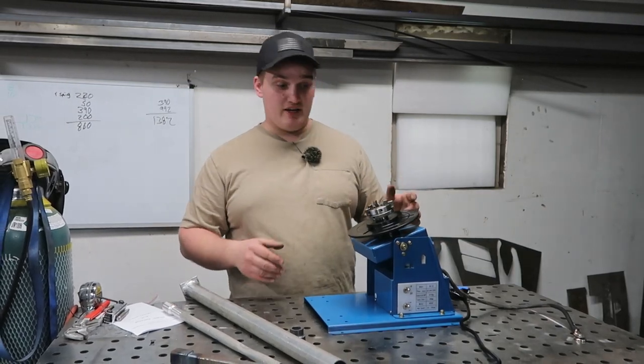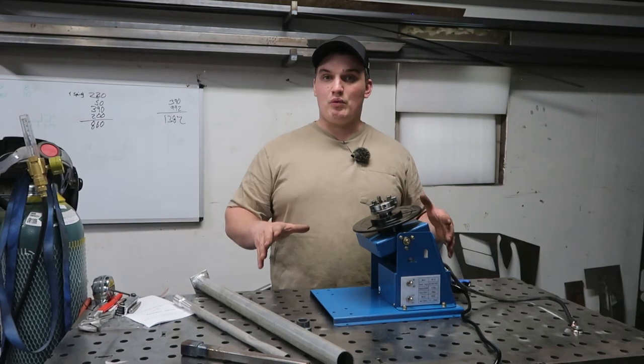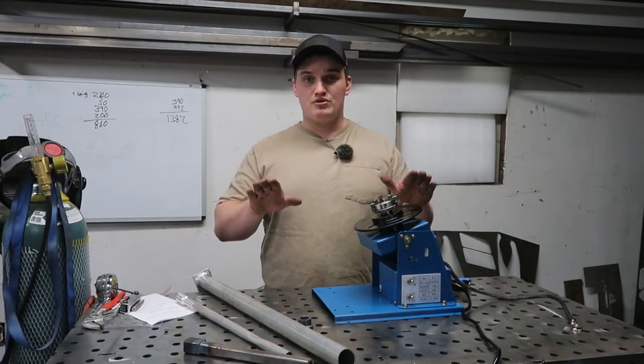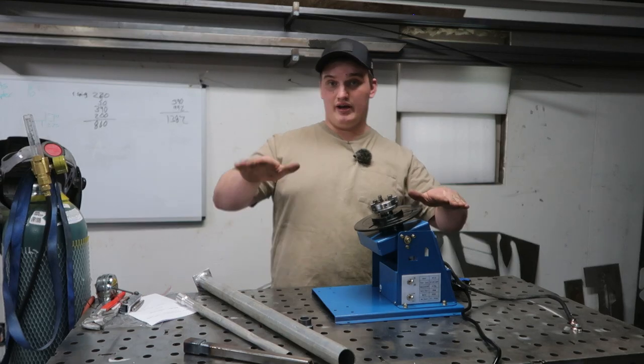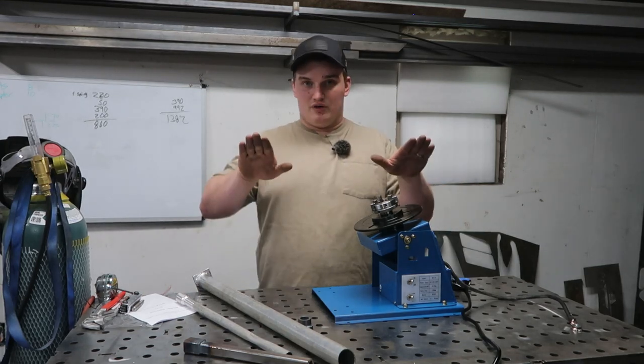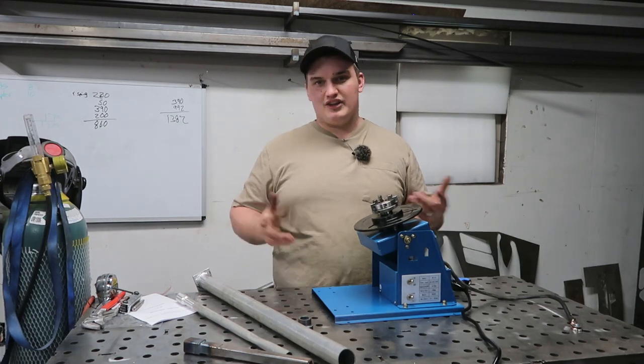The other thing I learned is it'd definitely be easier to use sitting down. I do most of my welding standing up, and with running two separate pedals, it can be tricky. Normally, with one pedal, you can balance with one and feather the other one. So when you're sitting on your heels trying to feather two pedals, things can get interesting.